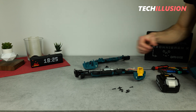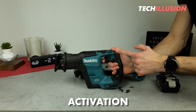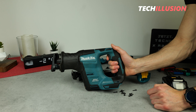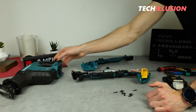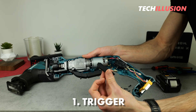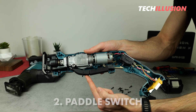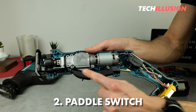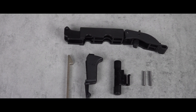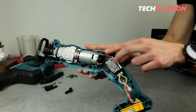What sets this small reciprocating saw apart from most others is the method by which the device can be activated. While most other devices can be activated solely through a thumb switch, the small DJR 183 from Makita has two ways to activate the device: on one hand through the trigger directly at the index finger, and on the other side through a very complicated construction — a kind of paddle switch with additional release, multiple support points and joints — ultimately activating the switch through a metal rod. From the switch, it continues with two more wires, plus and minus, directly to the motor.